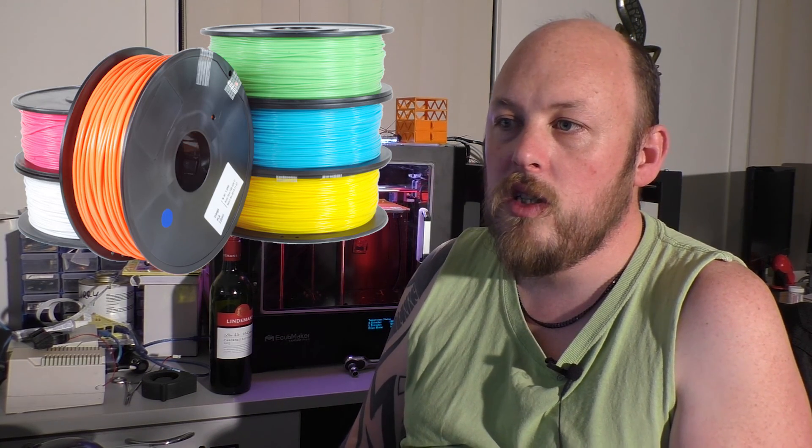Number six: best 3D printing tip. Use a really good quality filament. I'm not talking stupid-expensive rolls for every print because that's just not cost effective — find a brand that you like and stick with it. I really like Ararum filament, which is Australian made. And unless your bed's level, nothing's going to stick. The layers aren't going to stick properly, it's just going to look like rubbish. So level your bed, level it again, maybe one more time for good luck, and then use a good quality filament. You really can't go wrong.